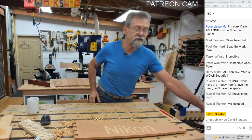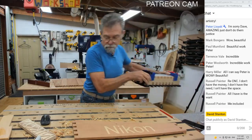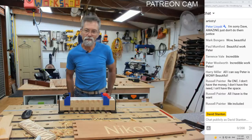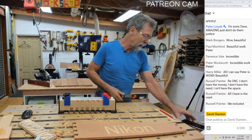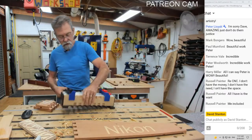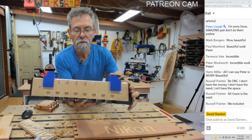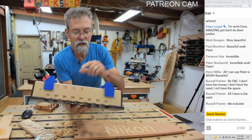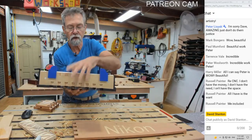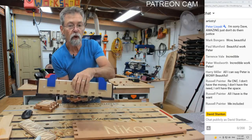Okay, next thing I wanted to talk about was the Gifkins jig. Now, last week you saw me make an absolute buffoon of myself. Not hard, you say? Yep. But this week I'm going to show you how I should have done it. Now, you always do the dovetails first. So you see on this side of the jig, it says dovetails this side. You can see the dovetail cutter there. I've flipped the thing over to be able to have a nice clean spoil board on the back.